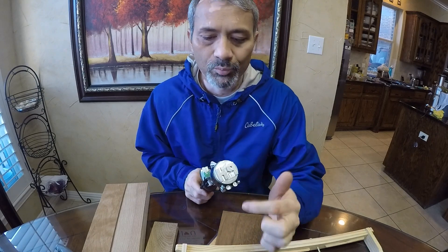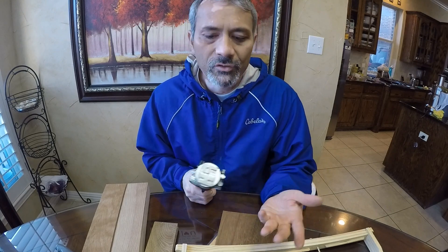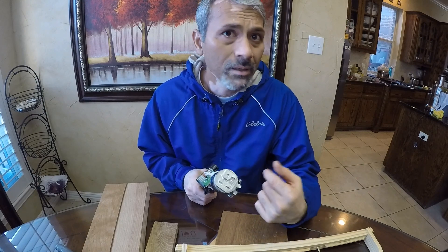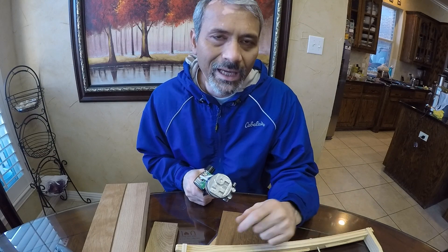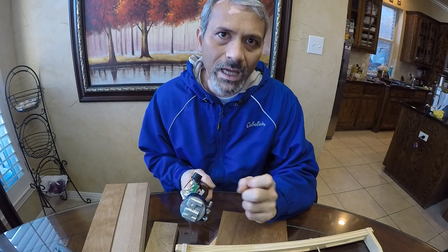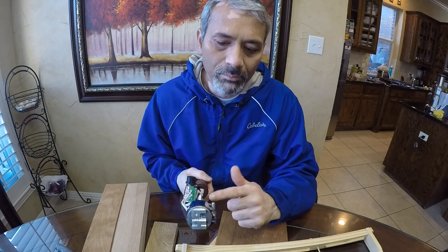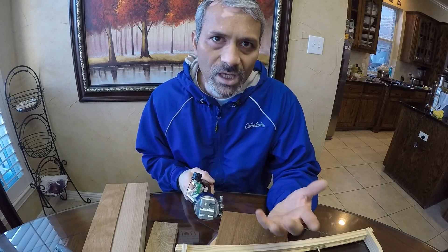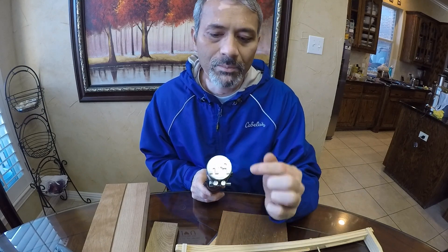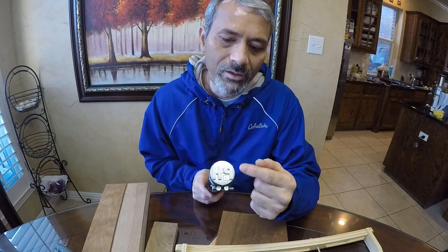I also wanted to talk about the branding block profiling. There are a number of ways you can make it. I have a milling machine so I made it with that. But if you don't have a milling machine or a lathe, all you have to do is find a brass or aluminum block that's close to the band heater diameter — it doesn't have to be a perfect fit, it can be a little bigger than 35 millimeters. Then you can use a Dremel tool to profile the pattern you want. The one thing to remember is you want to profile a mirror image of the pattern you're going for.